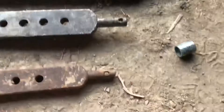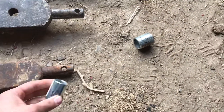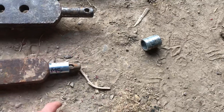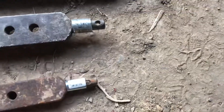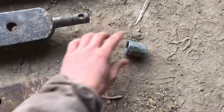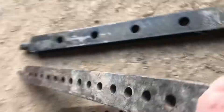So let's say you've got a tractor but the wrong cross drawbar — you can bush them out. This is a category 1 bushed out to a 2, and here's a 2 bushed to a 3. You just don't want to overdo it and have your drawbar fail on you.